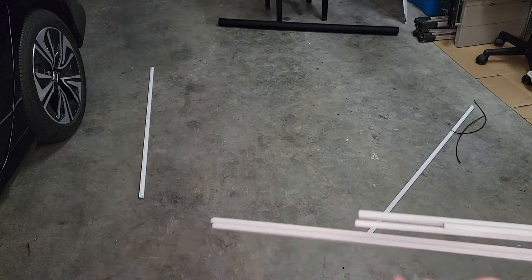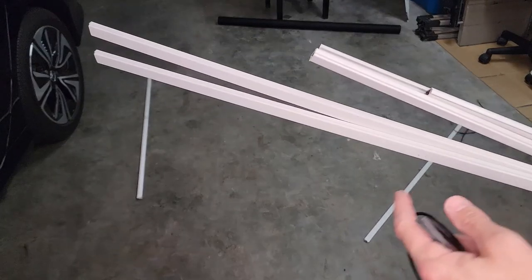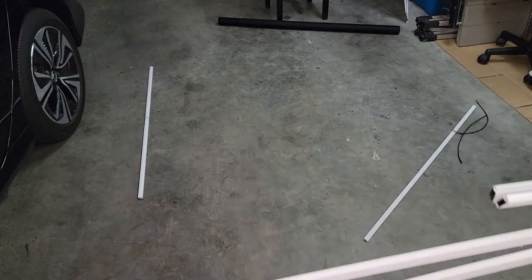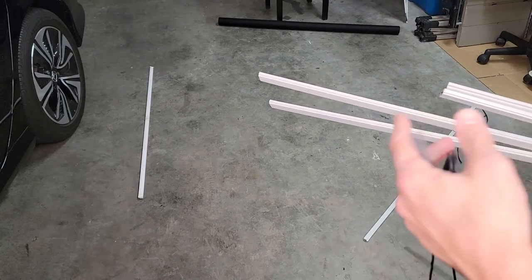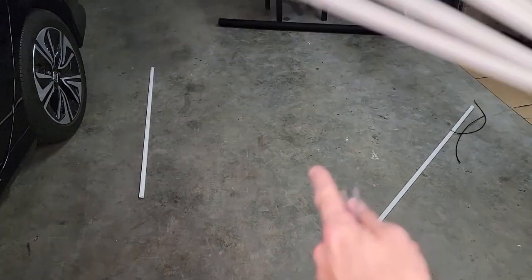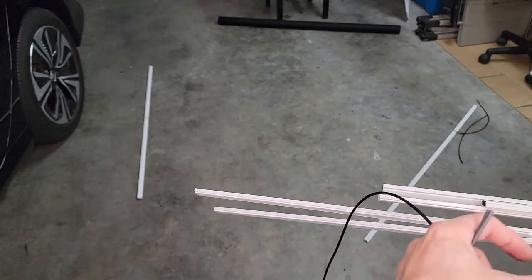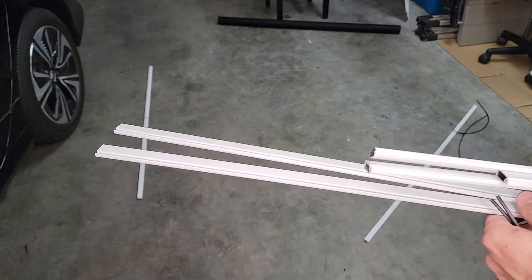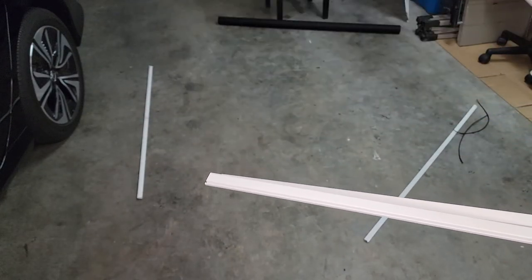We got our frame. If you don't have your old frame, measure your window from the outside edges and the top. As long as it's small enough to fit inside the outside frame of your window, but big enough to cover the inner lip that goes around it. There's usually a generous gap of about an inch or half inch you can work with. So just measure from your frame sides and up and down.